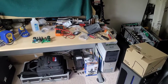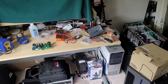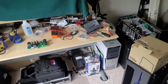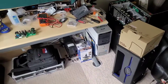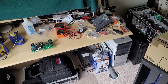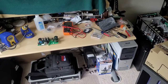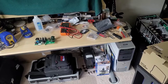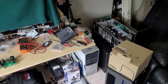Greetings viewers, welcome to my channel. Today's video is a troubleshooting one. The issue I'm having is a very nasty ground loop buzz when I'm using my PV VB3 tube amplifier with the XLR out going into either a mixing console or a recording console. Usually there are provisions on most amplifiers or mixing consoles to get rid of that buzz, such as a ground lift switch to remove the shield from a particular wire. Unfortunately that is not solving my issue, so I've decided to really dig into the amplifier and see where the problem is.